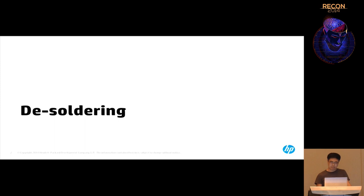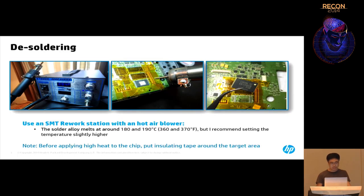The first process of doing reverse engineering is actually desoldering the chip from the PCB board. The method we are talking about is when you don't have access to a JTAG port or other serial lines — maybe the last option is just taking out the NAND flash itself and reading the flash image out of it directly. So the first process is desoldering.